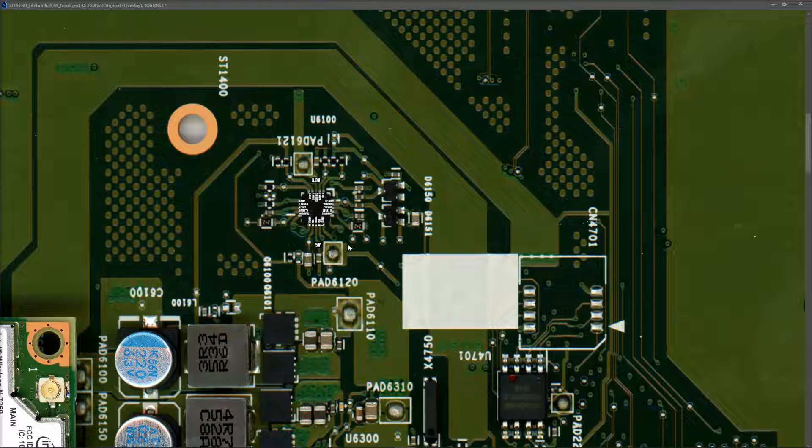That's where I'm going to leave it for this week. To summarise: we checked the main 19 volt power rail - present and good. We checked for 3.3 volts always-on - missing. The IC producing it was blown, so we replaced it and brought the 3.3 volt rail back online. However, when we reconnected the rest of the circuit, it kept power cycling, so there is still a fault on the 3.3 volt always-on circuit. Post in the comments what you think it is and I'll take it from there next week. Thanks, please like and subscribe!